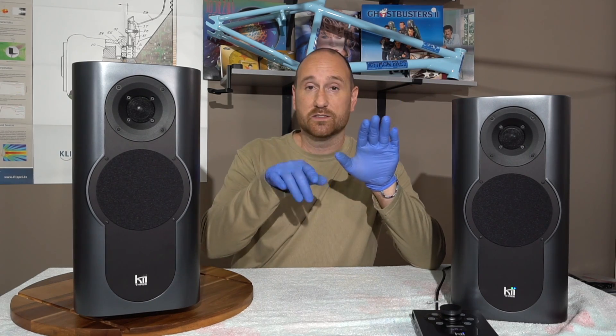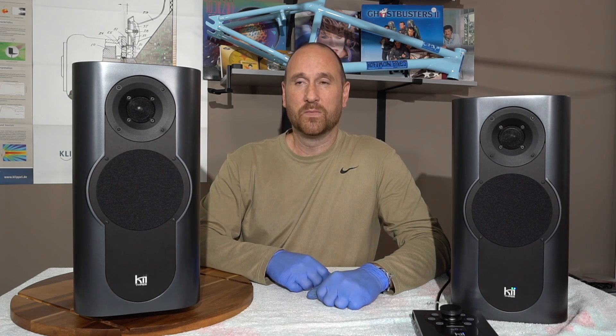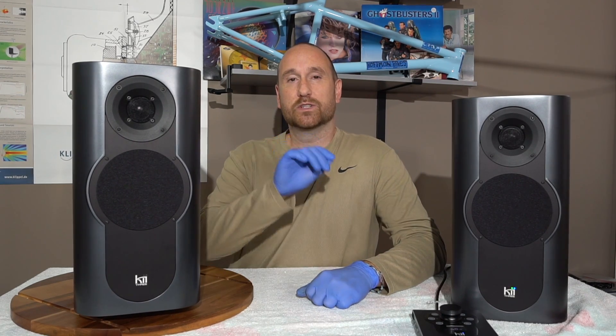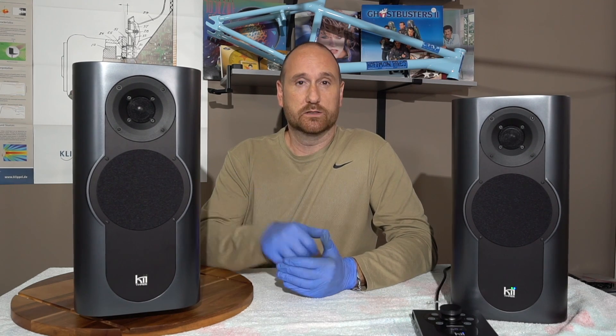If you close your eyes, you can hear the guitarist over here, the vocalist right in the center, piano, drums, et cetera — all within the stage. With this speaker's cardioid design, it has fewer reflections from the front wall. In my subjective experience, that means you still have as wide a radiation pattern as before, left and right, but you also have more precise imaging. The one that's omni tends to have less focus of those images, while this one has more focus of those images in the soundstage.